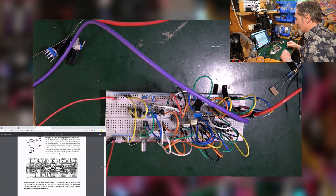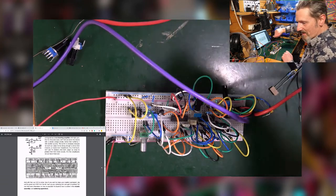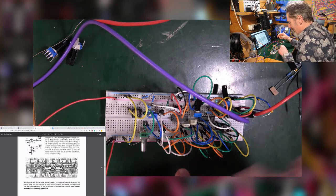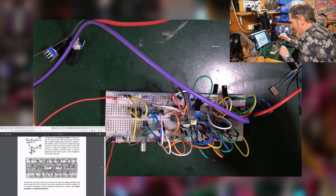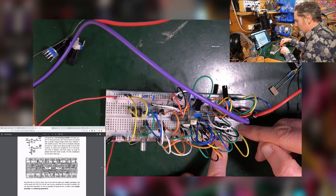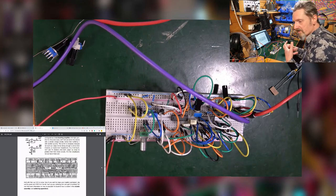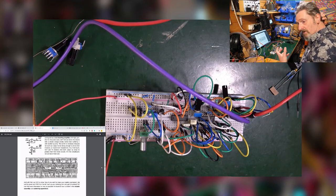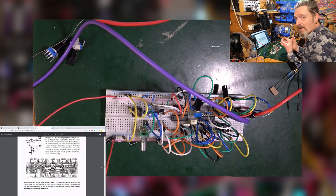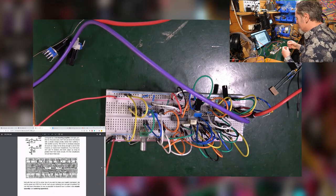Right, so at this point, turn it down to nothing for a minute. So that is a working VCO, pitch and pulse width modulation going on from the square wave. This output here is the sawtooth. That also works, no problem. But I wanted to give you an example of an oscilloscope solution and a tuning solution, which we'll probably use later.